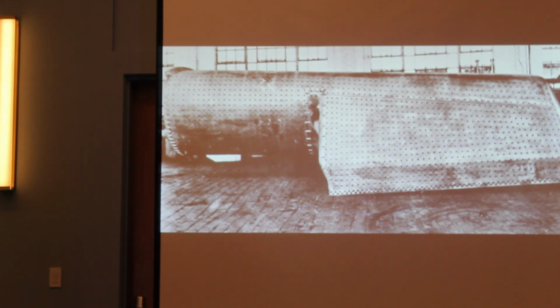You had to take 2 tubes out of the boiler at the bottom, not the top, not the middle, at the bottom, because that's where the most corrosion would happen. Everything settles to the bottom. Take these 2 tubes out, and if he deemed they were okay, he'd give you 1 more year of operation on a set of tubes. Of course, you've got to replace the 2 you took out.